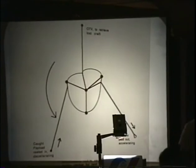I haven't mentioned vibration. You're going to have to be monitoring the vibration of this whole thing. Have your little corner reflectors a couple places down the tethers, so you can see the waves traveling down the tethers and dampen them out, either passively or actively. By the way, a passive damper is the little hydraulic cylinder on your screen door. They are very simple, and they are relatively fail-safe.